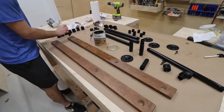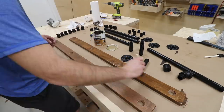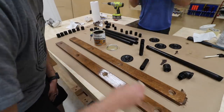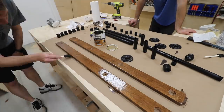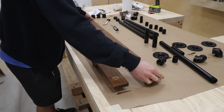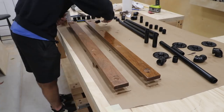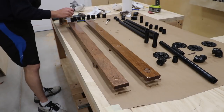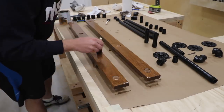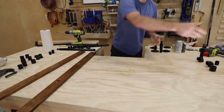The last thing to do for the wood is to apply a clear coat of polyurethane. This is a semi-gloss sheen. It needs to have multiple coats. It was applied to one side and the edges, then sat for a couple hours before getting the second coat. Once those two coats had several hours to cure, I flipped it and applied the last two coats on the other side. All these coats were done over the span of one day. I let the polyurethane cure overnight, and then it was time to assemble it all.